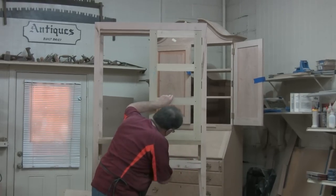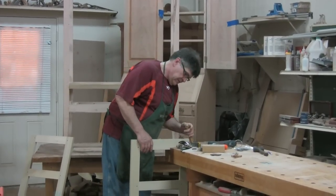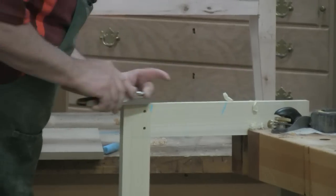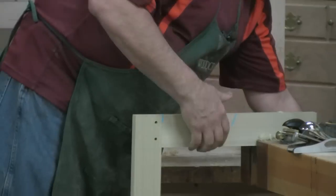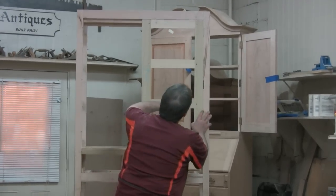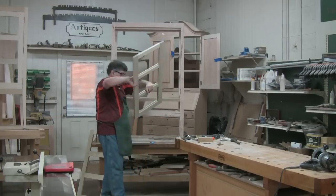I've got to go from, I'm really tight on the end, a little bit tight, a little bit right here. Now I'm set really light on this plane because I want to sneak up on it. I want to ease into it. I don't want to get drastic. All right, she's coming in. A little bit more. Now, the other thing I could do is, because I'm loose here, tight here, I can also shave a little bit off of this side.